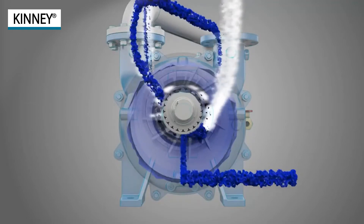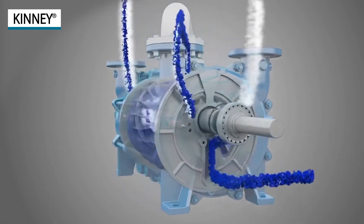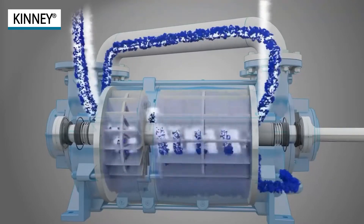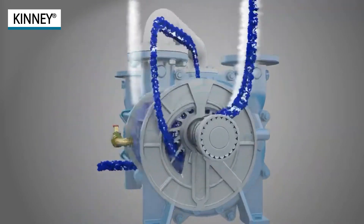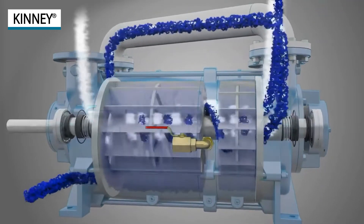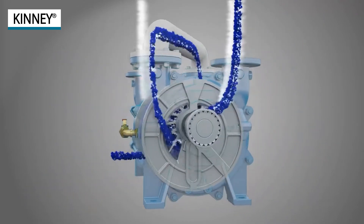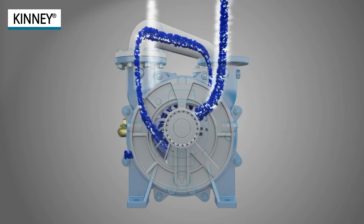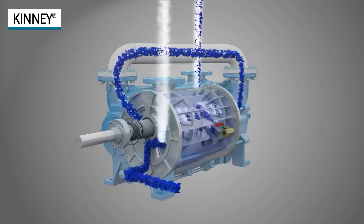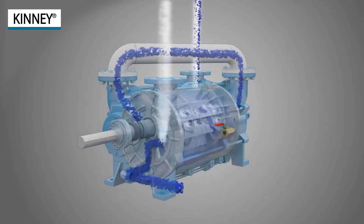The pump's axial suction and discharge ports are exposed to the void, but separated by the impeller blades and the ring of liquid. As the process gas or vapor is drawn into the pump through the suction port, it is trapped between the impeller blades and the liquid ring. The rotating blades enter deeper into the liquid ring, progressively reducing the entrapment space, compressing and then exhausting the gas through the discharge port. The liquid ring acts like a liquid piston, meaning the entire pumping operation is accomplished without vanes, valves, pistons, or any metal to metal contact.